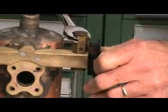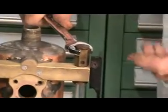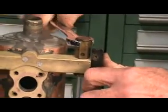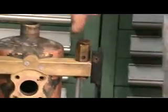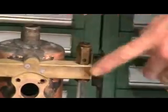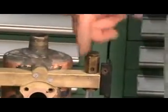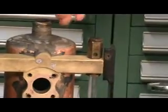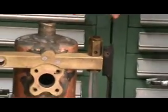You don't have to overdo it. You don't have to hit it with a mallet. You don't have to worry about breaking the sight glass because you've twisted the frame. You just take it down with that nice Teflon seal. And the beauty, once again, is that you can reuse this seal over and over again. And once that's in place, if it's the copper, you don't want to go back because you can't reuse the copper.